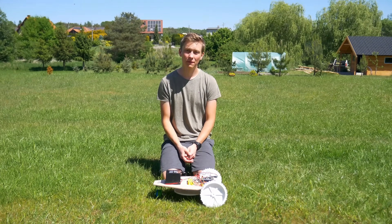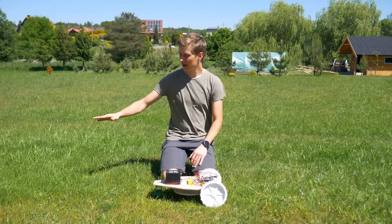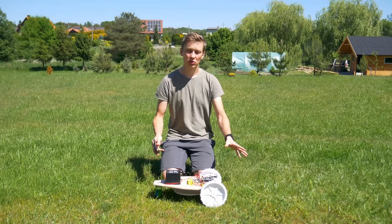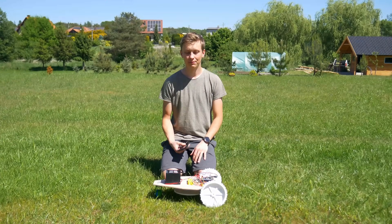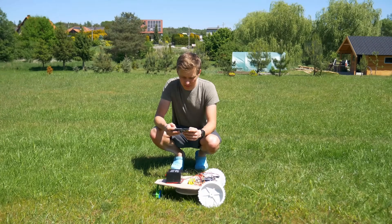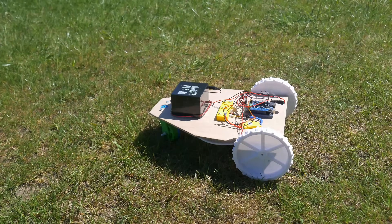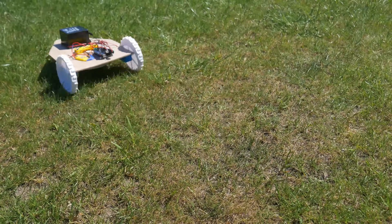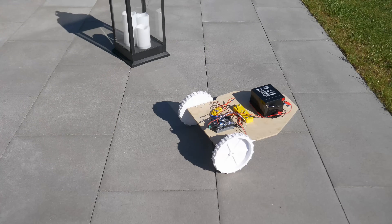Here it is ready for the first test. This test will be focused only on driving capabilities — the ESC is already connected, the disk is mounted but the blades are not, so I'll just see if it can drive around the grass and if I can control it remotely through the smartphone, because the Arduino is already there. There's no autonomy and no boundary wire in the grass yet — I'll focus on that later. First driving, then cutting, then autonomy in the next videos. Unfortunately the motors didn't have enough torque to run the robot, so I tried on a different surface and it worked okay, but there were a lot of problems: the front wheel had strips that were completely unnecessary, the battery was in the front, and generally a lot of things to improve. But it was a good start.